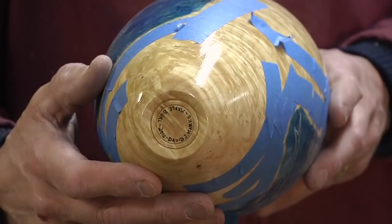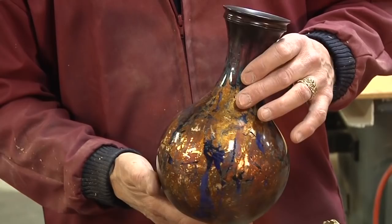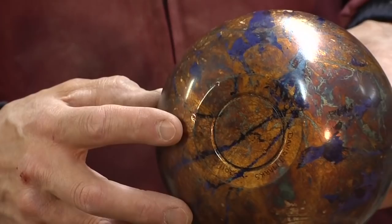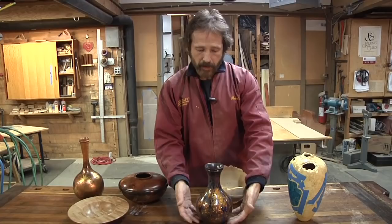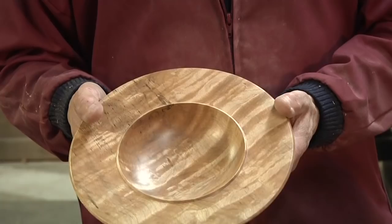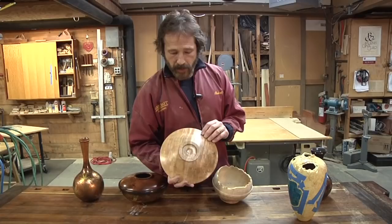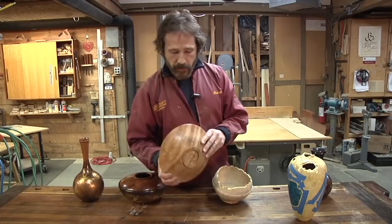Here's another one I've turned — this one I've done with my gilded patination finishes, silver leaf with patinas on it. I like to put a little groove in there. I also want that rounded form to round down into the horizontal plane and have the foot kind of disappear. This is an older piece out of some quilted maple. It's got an OG curve on the bottom shape and an inset ring with more details in the center. I like this foot — I slightly cut it in so that when it sits on the table it has a good solid foundation.